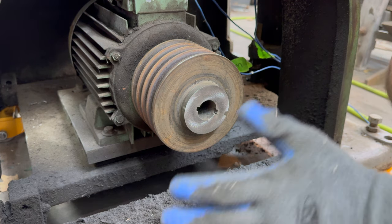This one has acetone as one of the main ingredients, which is no doubt why it can be sprayed. This has some other solvents. Now, I believe, because acetone will evaporate very quickly, I can make my own spray. We're going to try that today. My guess is to start with 150 ml of paint stripper, and let's add a little acetone to see. And stir.